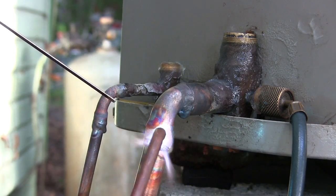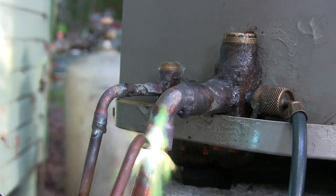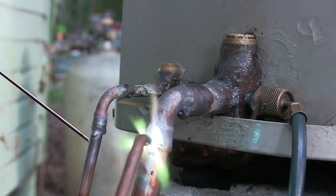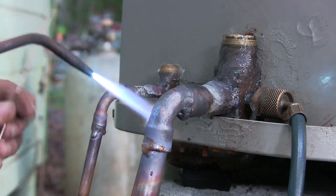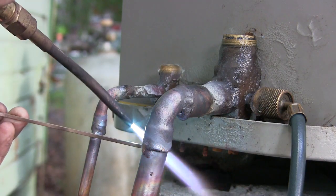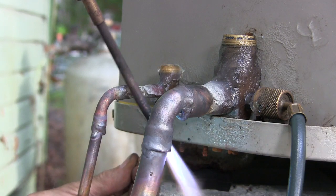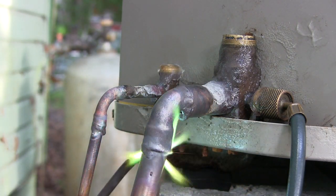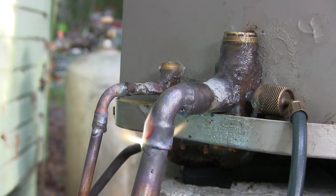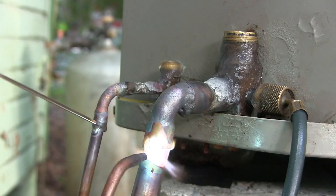Let's heat this up. To get this started, I've got a little braze — a little solder there. There's always the backside of anything that you can't see where you're going to have a leak every time. Probably one of the most annoying things of brazing air conditioning equipment — it's always the backside where you don't hit a spot quite right.